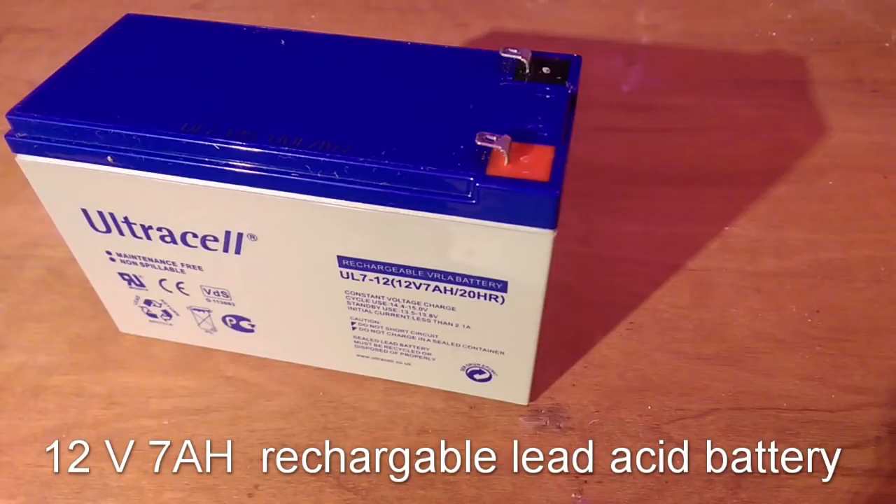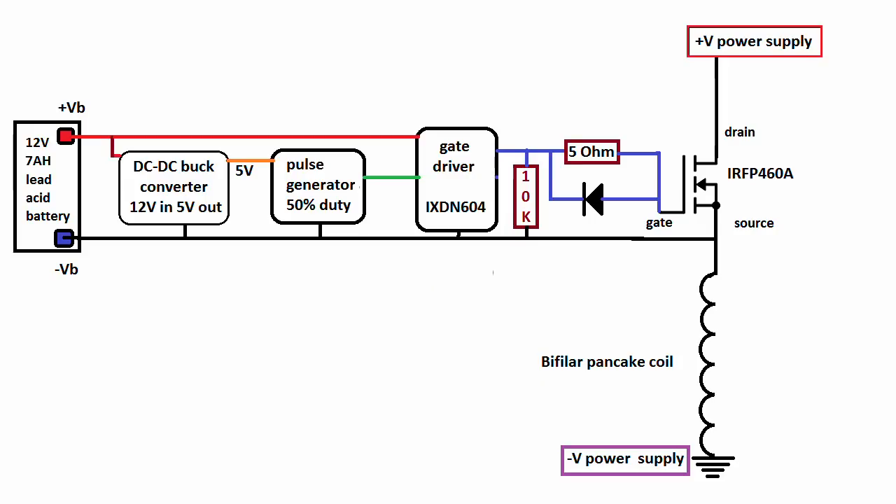What I'm doing is reusing the negative voltage back EMF. To produce it, you have to switch on the high side of the coil. I used to use a pulse gate drive transformer and it was really hard to learn. Finally I realized it and it's just not good enough. I switched to another device and it's really easy — I just used a 12 volt battery, and it's riding on top of the source voltage, grounded with the negative of the battery to the source.